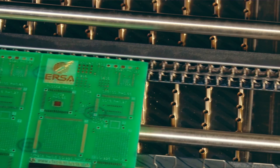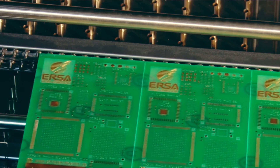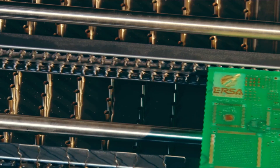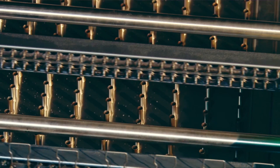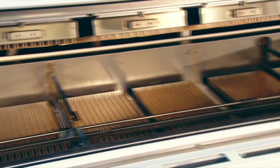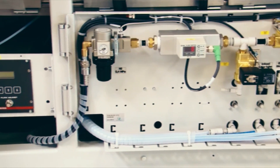How do we do this? We have an individual control of the fan speed in every zone. And this — maybe you don't know that — but half of the energy in your reflow oven is coming from the fans, and the other half comes from the heating elements. By controlling the fan speed, you will control a lot of the energy use in your machine.